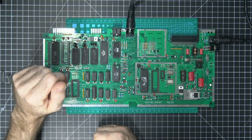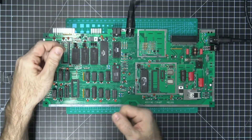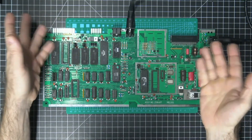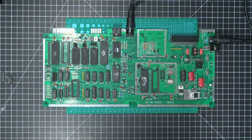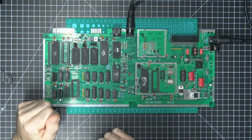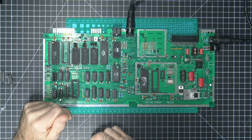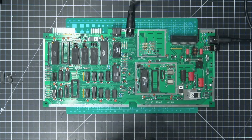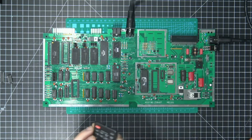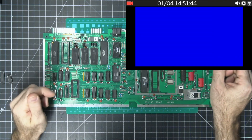While this is cool, switching between the different images on the ROMs using these jumpers also becomes kind of a hassle, because now you've got to open the top of your case every time you want to change ROMs. So I figured, why not use the same kind of switchless technology that we used before with the PIC microcontroller — to build the switchless kernel ROM — to switch between all of these chips.